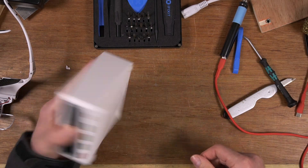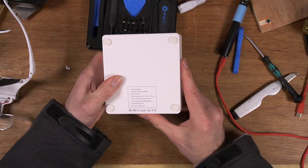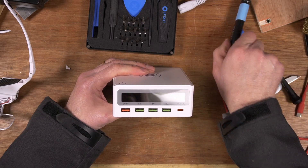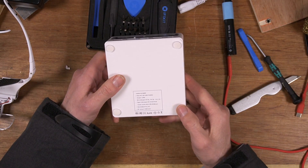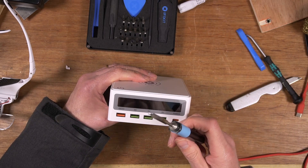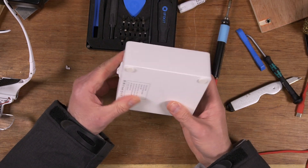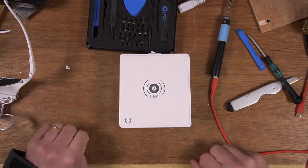Not ideal — I wish I'd known about it before I bought it, but you live and you learn. I can't recommend the cheap Chinese one — I don't recommend it if it's got this earthing problem. I've had problems like this before on other devices and it's not pleasant when you go to attach something or touch something on a board that's sensitive and you get 100 volts worth of sparks coming out. I don't think it's high current so it's not going to arc-weld the tip of your iron to the board, but it's enough to probably damage some silicon if you're unlucky. So yeah, not recommended — hope that was useful.